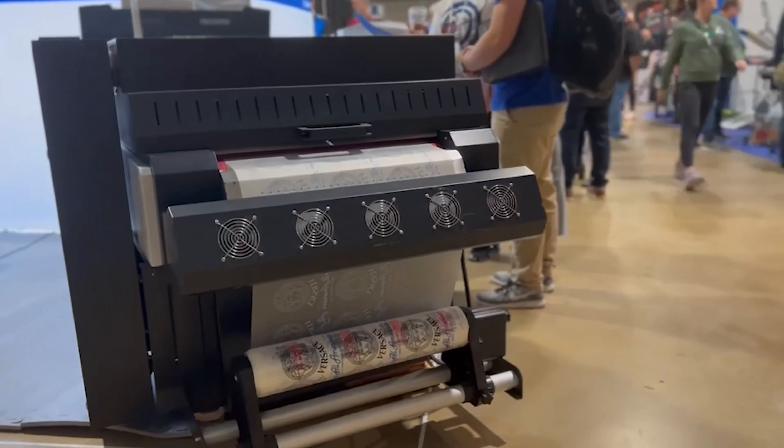After it shakes off all the powder, the next step is drying. If you have a heat press, you can lower and hover and cure your direct-to-film transfers like that, but it takes a little bit more time. What we have here is a vacuum system that keeps the film nice and tight to the belt and feeds it into this conveyor. This is actually a take-up reel, so what we have coming out are fully finished, ready-to-apply transfers. At this point, we can stick them on to almost any material possible, send them out — someone else with just a heat press is basically a full-blown print shop using nothing more than your transfers. There are companies out there that sell these as a service, and that could be you.